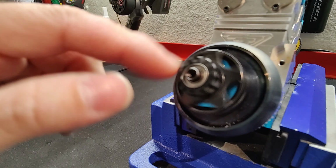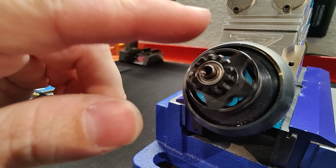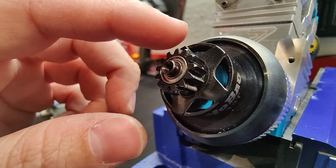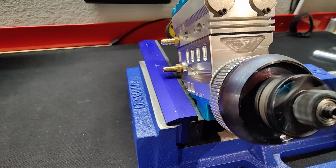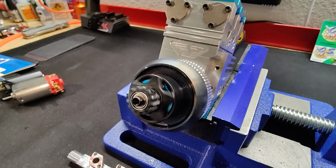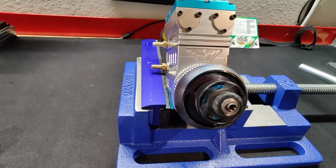You're just going to start eating away at the flywheel. So with this thickness, around 1.3, 1.4, what I measured, it perfectly keeps the gap there on the flywheel and allows it to just spin freely. But if you look at it, it fits perfect on there. It's almost like it's made for it. So that worked out perfectly.